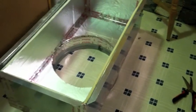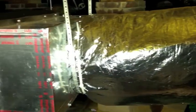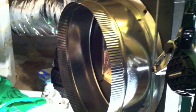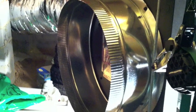I bought some of the equipment from a local HVAC contractor, including the round transition. I replaced my return ductwork with a 16-inch duct and attached it to the side of the unit with the box. This is what I attached to the existing supply box where all the ductwork comes into the house. I got from Ingram's what's called a duct takeoff to attach to the side of the unit.